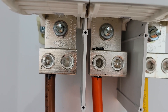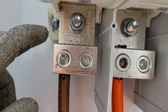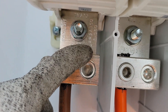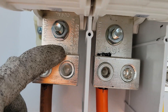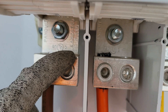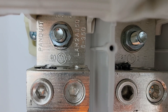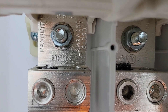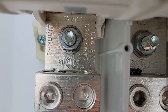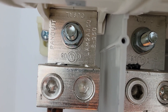The lugs we're looking at are manufactured by Panduit — right there is the name. They're UL listed, and this is the model number: LAM2A350. This next number here is the rated size of wire, so it'll hold anything from six gauge to 350. It's also rated for copper and aluminum, shown at the very top, but nowhere on here does it tell me the inch-pounds or foot-pounds of torque to apply.